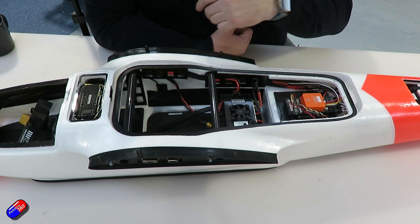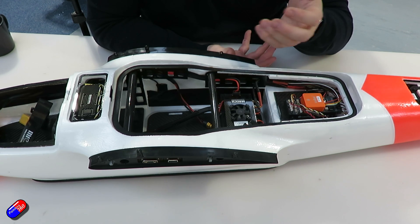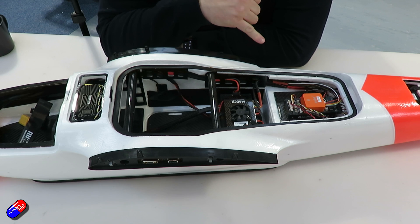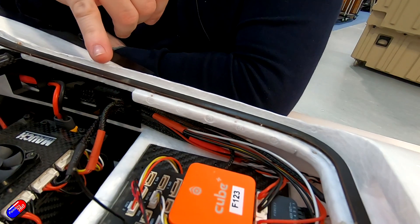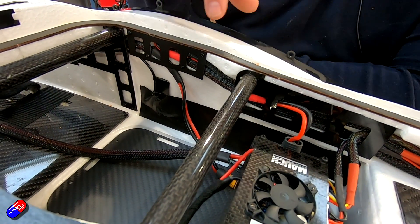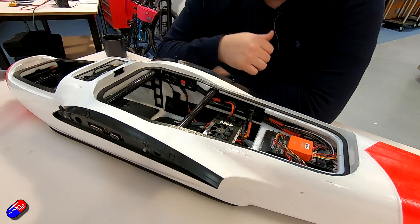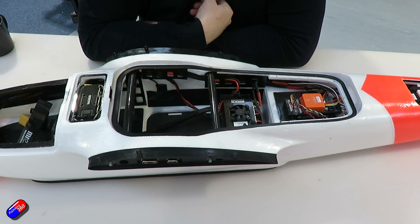You can also disconnect the left and right wings. This would still be possible with the Tarot block too. It gives easy access to disconnect motors when you're doing servo testing or bench setup. We've left those exposed — on a training aircraft that works really well. We've paid a lot of attention to wire routing: power cables wrapped nicely, sheathing on all servo cables, printable heat shrink to label everything. We also use a gummy glue heat shrink that sticks and doesn't slide wherever it crosses through any hole or hatch. We cut wires to length and crimp ourselves for the best fit.